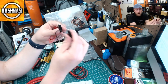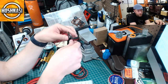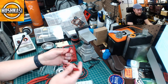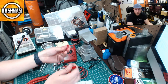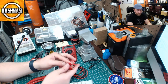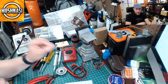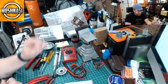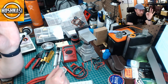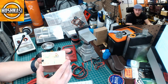To go along with your multimeter, it's a really good idea to make jumper cables — just wire with two alligator clips on each end. These are helpful when working on a breadboard: clip one leg onto a jumper on the breadboard and the other clip onto your multimeter probe. That allows you to probe with one hand instead of managing two, making things very easy. Totally recommended.